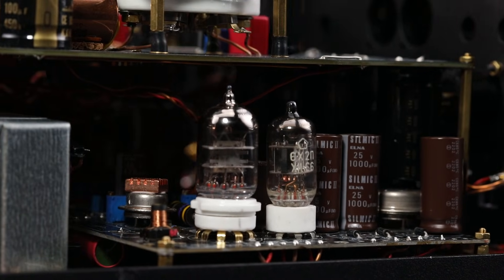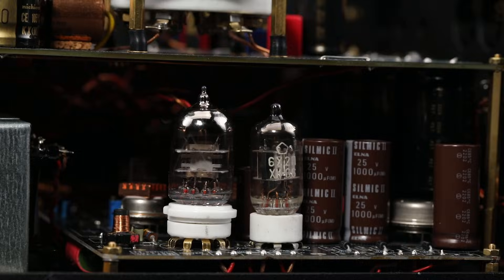We took the technology and the idea, developed it, and made it work with vacuum tubes instead of transistors. We designed an active frequency generator feeding the TDA1541 and TDA1540, built to run on tubes — technically a tube-based pacemaker that feeds and regulates the accuracy of all the switching processes within the active 6-bit MSB dividers. This gives us the most ideal results when it comes to reproducing digital data and converting it into an analog musical signal.